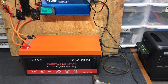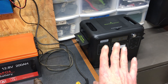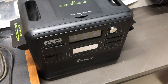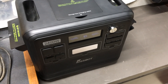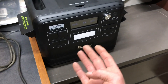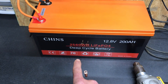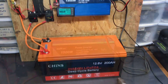That said, there are pros and cons to each path. With a pre-packaged unit, if something fails inside, all the little parts are integrated together — it's almost unrepairable at home unless you're an electronics expert. Check back on my channel in a few days — I'll tear one apart so you can see what's inside and compare component sizes. With a hand-built system, if one component fails you just remove and replace that component, and if you need more power you can add capacity very easily. Those are real advantages of a home-built system.